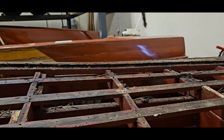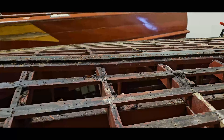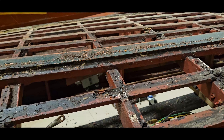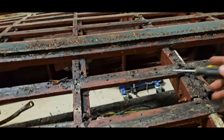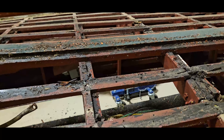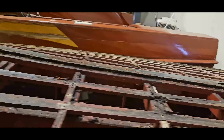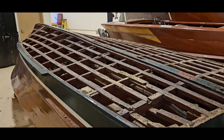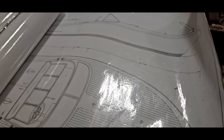The first thing it could be is the breakdown of the lignin in the keel due to oil intrusion. The second thing is that it could be a design feature. We're going to have to refer to the original blueprints of this boat to identify whether that dip is actually part of how the keel is supposed to look, or if it's slowly sinking due to oil intrusion. In the boat world, this is referred to as a hog. You commonly see it on larger boats — you typically won't see it on these tiny short little boats.